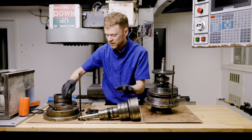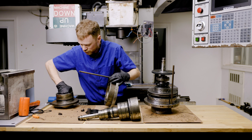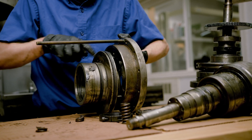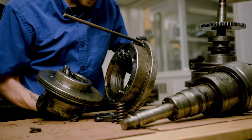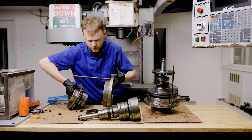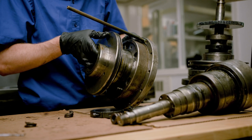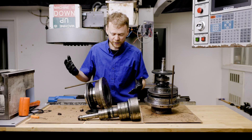So this is the whole turret shaft. Between this piece and this piece are two air cylinders and the springs that help it unclamp. Air pressure is either applied here and here to push it forward, or here and here to push it back. The springs, the pin — this is a pretty tight fit inside of here. The springs break, which then tumble around in here, the seals give out. This is literally how dirty it was when I tore it apart, then this shaft goes through it.